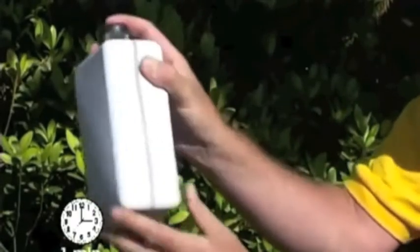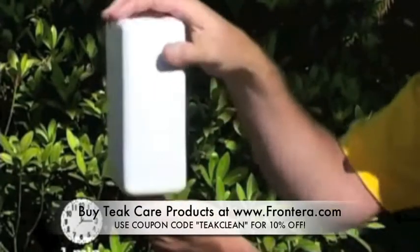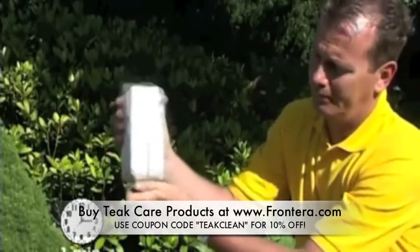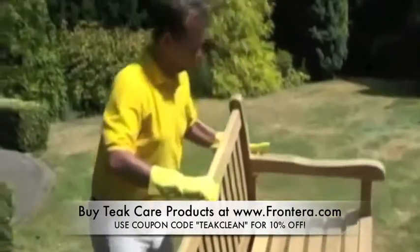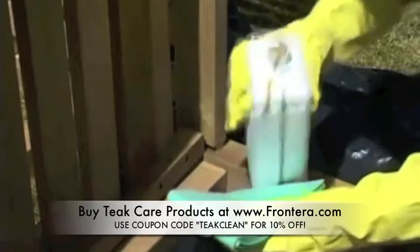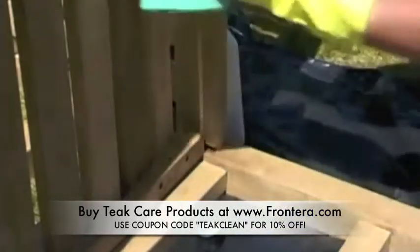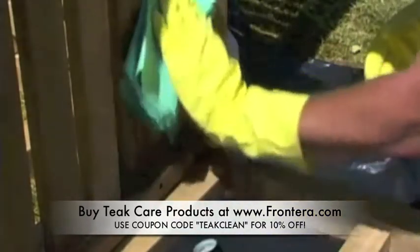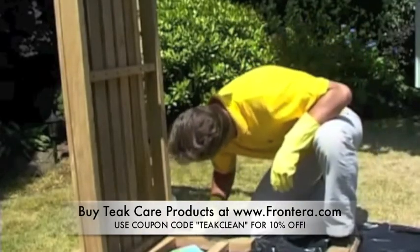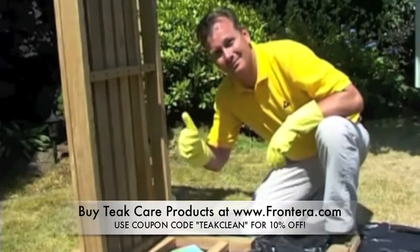Shake the bottle of teak protector for at least a minute before use. If this is not done properly, it can lead to variations in colour. Shake the bottle again after about an hour during application. We also recommend applying the teak protector to a small inconspicuous area of the teak, for example the underside of a chair seat, so that you can judge for yourself whether the colour of the protector meets your expectations.